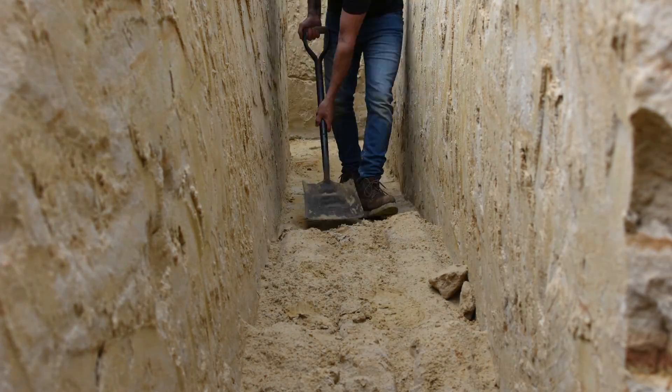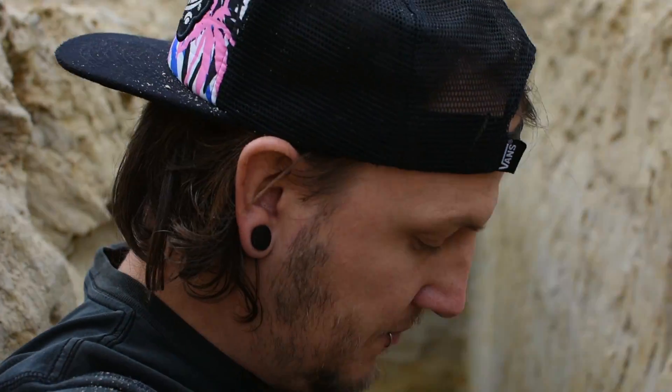Just keep going around — that's the first one. I like having a nice crisp finish so you've got no worries whatsoever. So when that concrete does go in there, it goes in there level, flat, nice, square — just a bit of perfection. If anyone out there is thinking about having an extension done or a house built, just pay careful attention to every detail. Don't be surprised if you spend thousands and thousands of pounds on concrete in the floor that you are never going to see. There's a hell of a lot of stuff when it comes to building that you will never see that are most likely the most expensive parts. The footings are here specifically to hold your house up, hold your extension up, stop it from sinking into the ground.